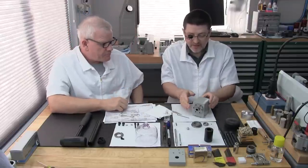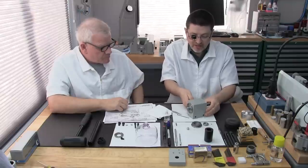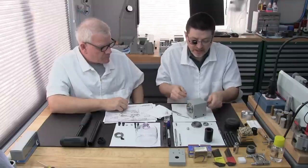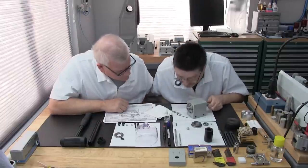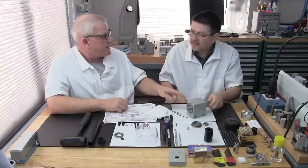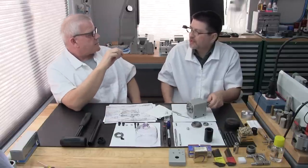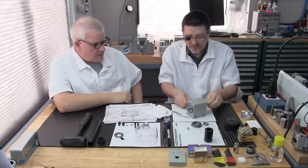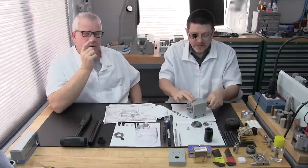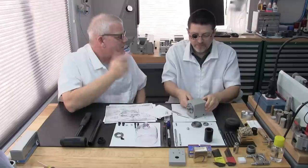That's right, through the harmonics. Especially now, what I test for is, I pull it out, make sure it's in the unlock position, and then I turn and I listen to make sure you don't have anything hitting. Like that pin rubbing on maybe the outer diameter of the locking slots on the outer collar. Right. So it's just completely free. These are good things to listen very close for. That's why we don't want you to listen to any music or anything when you're doing this work. We want to listen to the spindle talk to you.